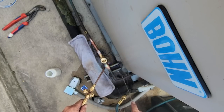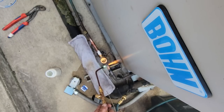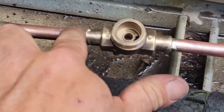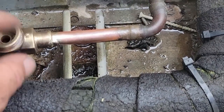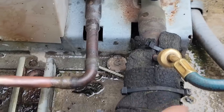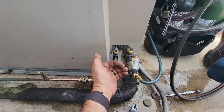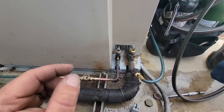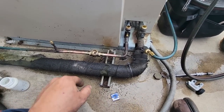The one I hate the most and have the most problem with is usually brass to copper. Let's see what we can do with it here. That brass takes a lot of heat. Get that heat on the back side — boy, that's in a bad spot. Cleaning it up a little bit with the brush wheel makes it look better and gives you the ability to kind of check into the joints a little bit better with your mirror and make sure it's all good to go. Kind of go ahead and put it together, do a pressure test. I think I had to replace this once before, that's why I have these valves here. I was able to isolate it from the refrigerant charge and do a little bit of a pressure test here. Don't want to go too high — don't want to push the nitrogen into the refrigerant because you can contaminate the system, and I have done it before.